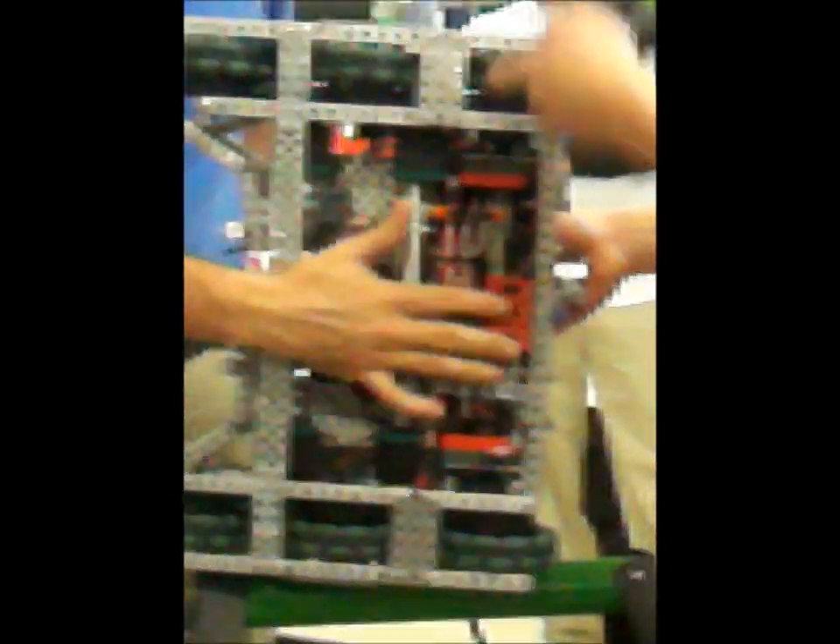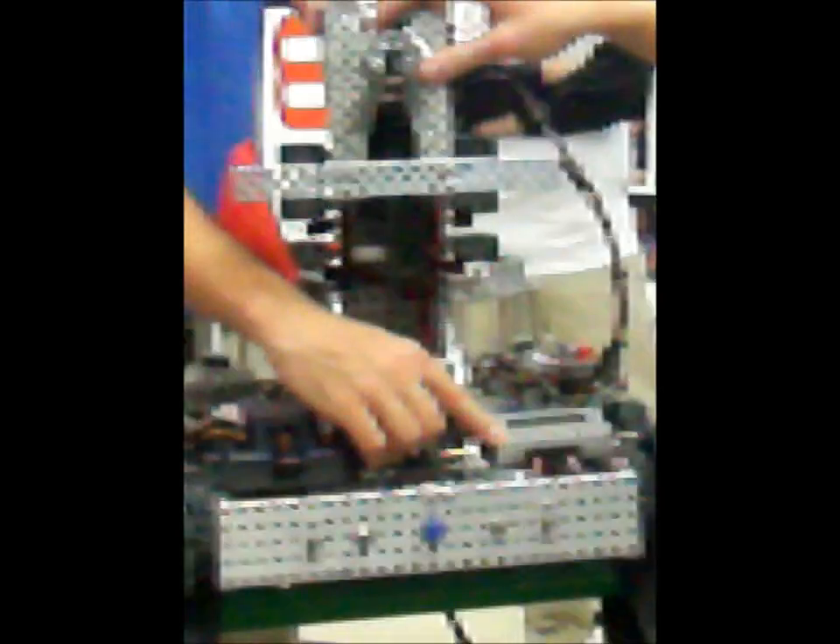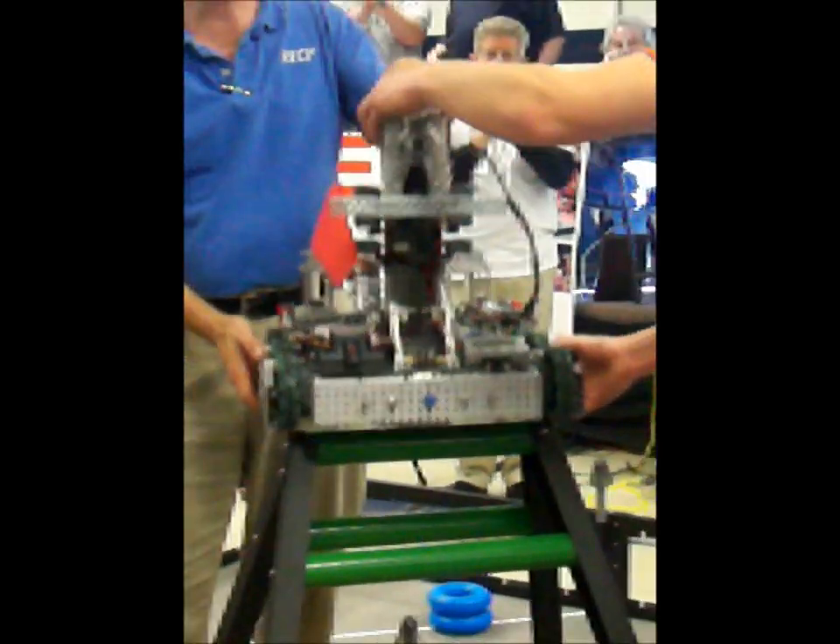On the bottom you'll see three little red boxes — line sensors used to detect the white lines on the field, so the robot can follow a white line all the way around when programmed to do so. On the back he has an LCD display, which is new to VEX — you can send messages to it and dial in different routines and programs, configuring the robot on the fly. He's using virtually every piece of technology that VEX offers. Thank you very much for your time.